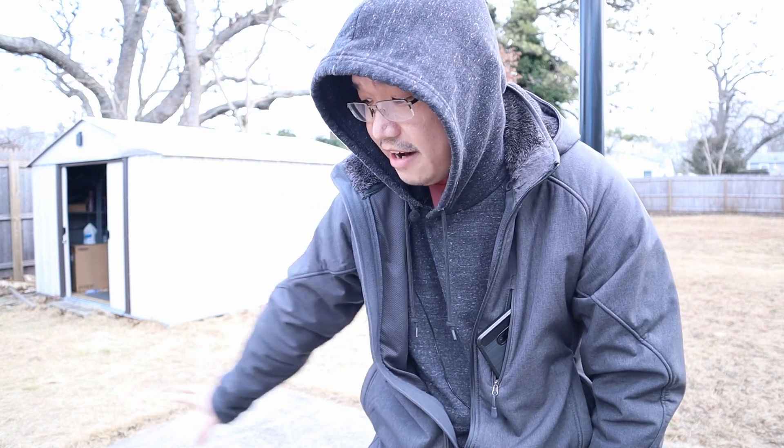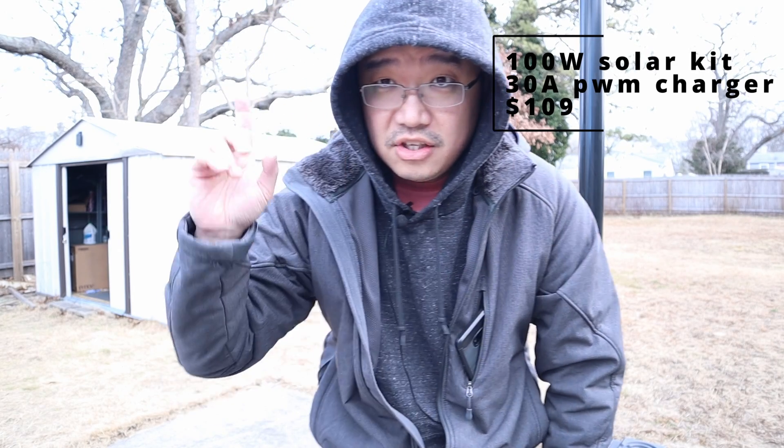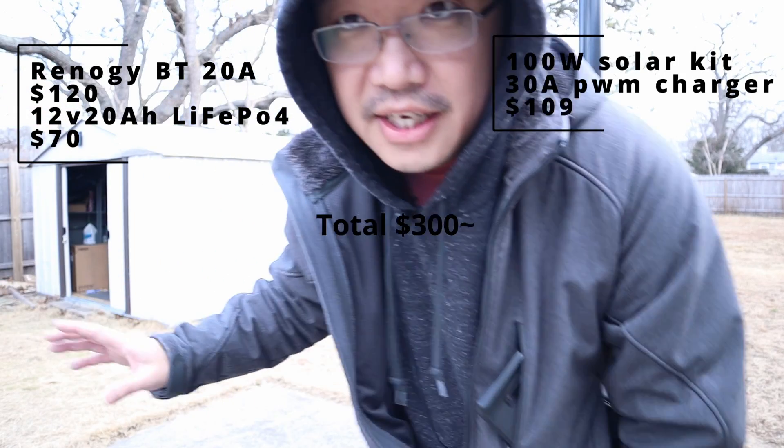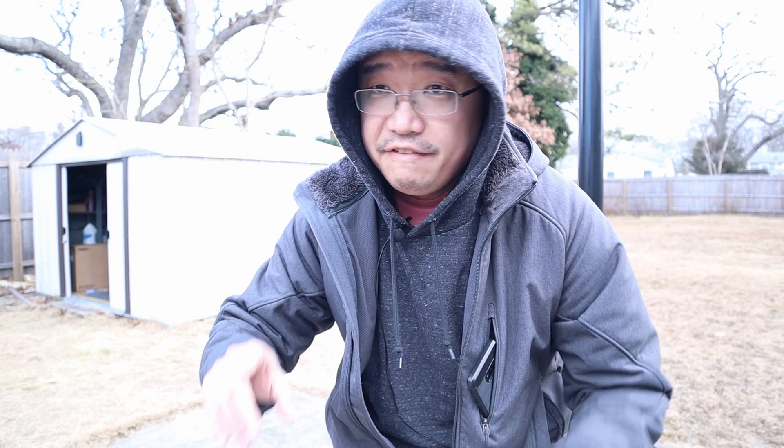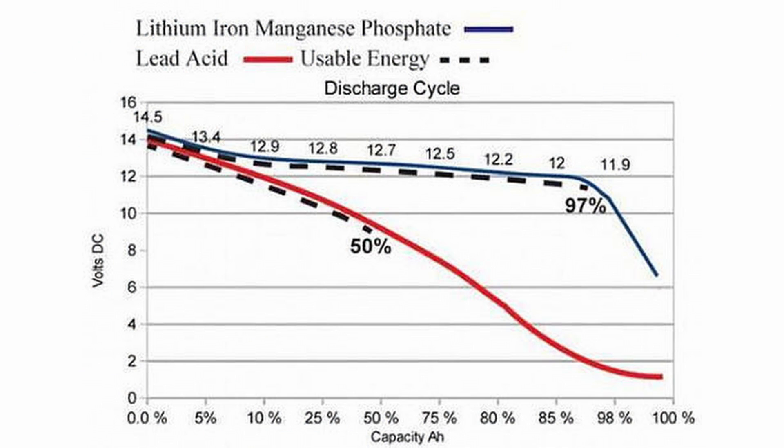Total cost of getting everything together — I'll leave it on screen. I have the initial kit setup and then the stuff I added on top of that. Now I learned a lot after the fact: solar panel comes in to the charge controller, which charges the battery, and then an inverter to use the battery — those are the basics. But there's more to it, especially facing the panel southwards towards the equator for optimal sun, and choosing the best type of batteries, since LiFePO4 batteries have 5,000 charge life cycles. The shed happens to be facing southwards and is tilted at a good angle, so it's pretty optimal for this type of setup.